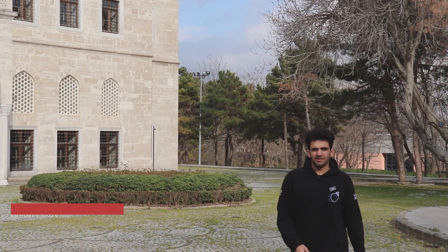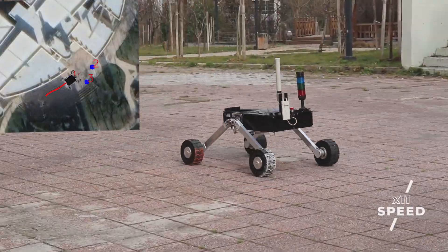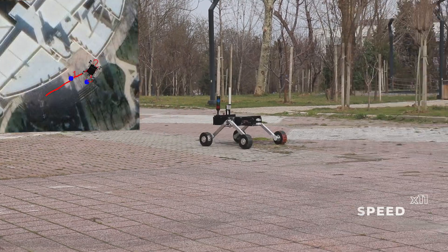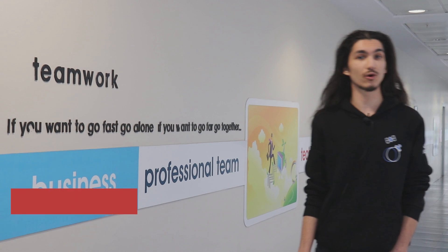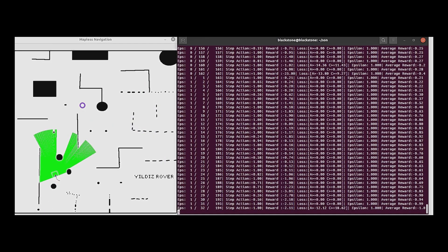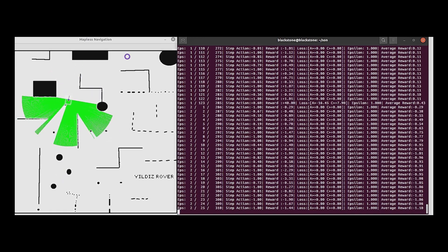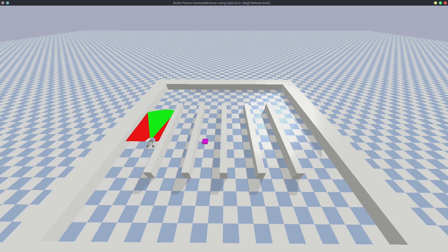Our custom-designed Mission Planner uses various sensors such as IMU, LiDAR, RTK GNSS, and wheel encoders to localize the Rover on the map. The Mission Planner also connects to the Google Maps API to retrieve the latest map data. An Extended Kalman Filter is implemented into the Mission Planner to fuse all movement data from the Rover. We designed a reinforcement learning-based autonomous driving software which includes a deep learning environment developed through a custom R&D process, enabling lower memory usage and faster response times compared to ready-made alternative packages.